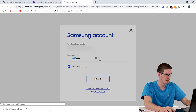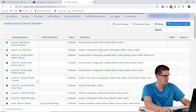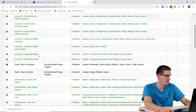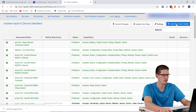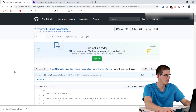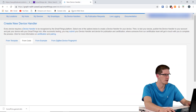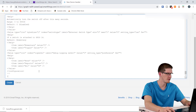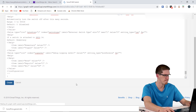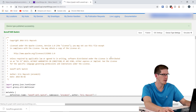Go through the sign-in, or sign up using your SmartThings information. Then go to My Device Handlers at the top. I already have some Sonoff device handlers here. Go to Create New Device Handler in the top right corner, click From Code, go back to the GitHub page, click Raw, select all with Ctrl+A, copy it, paste it into the new device handler field, click Create, then Save and Publish for Me.